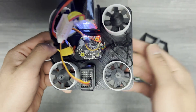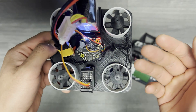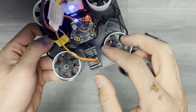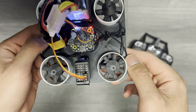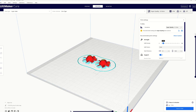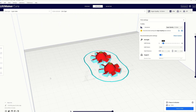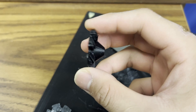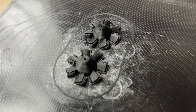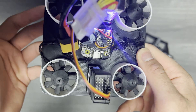This design, at least structurally, is pretty simple. The real point of this project is to test how well my homemade fans would perform, and the result is not well. I had a ton of issues even being able to print a fan this small. These fans are 33 millimeters total in width, so any type of detail is extremely difficult to print. This is the final design I landed on, using supports to print the actual blades. As you can see, there's significant warping and inconsistencies particularly on the edges, leading to imbalances, which is the cardinal sin of propeller manufacturing.